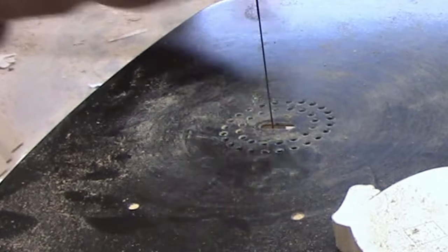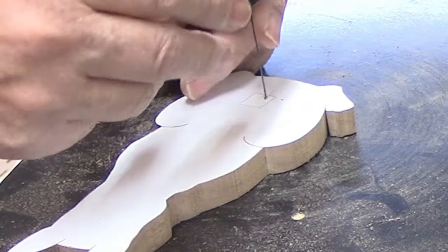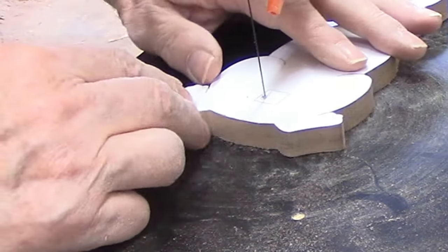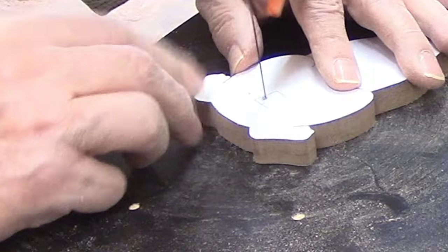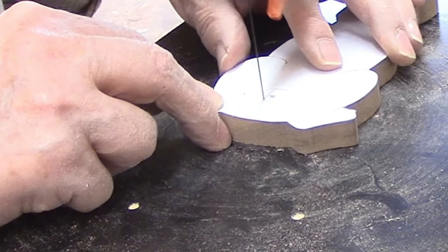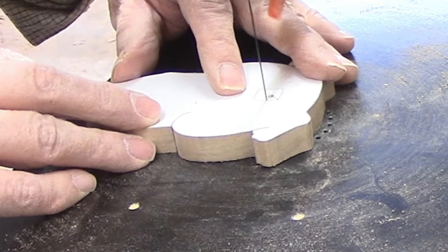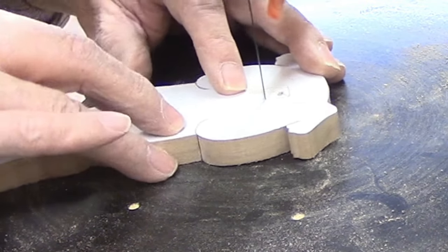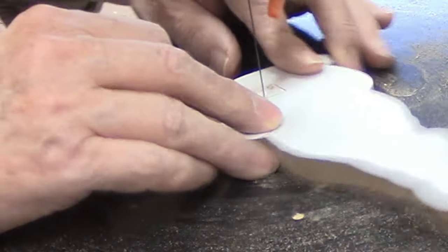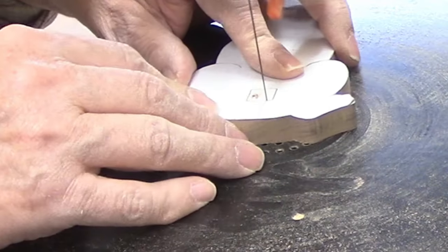The next logical step was to cut the square slot that the dog's tail would fit into. I thought this was a simple yet clever design — the slot and tab will provide a lot more strength to the tail than just gluing it onto the dog's body with a butt joint. I have to emphasize that for this to look right, and for there to be a tight connection, this slot needs to be square — the corners need to be square, not rounded. Square is key. I cut from the pilot hole to a corner so the tip of the blade touched the point of that corner, then backed off the blade very slightly, pivoted the workpiece 90 degrees, and started cutting again right on the line. I followed the same procedure at each of the four corners.